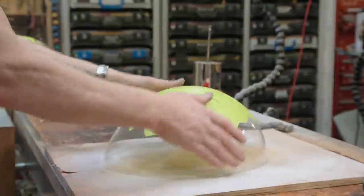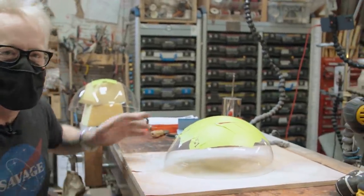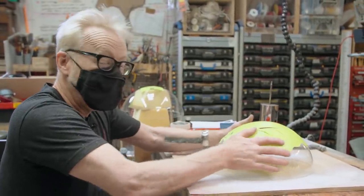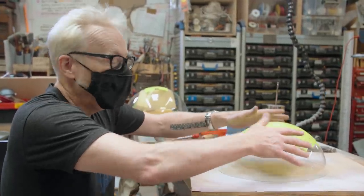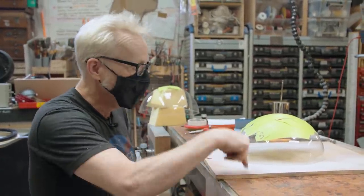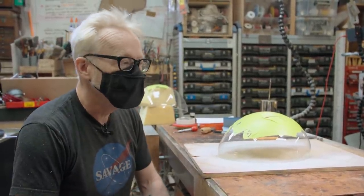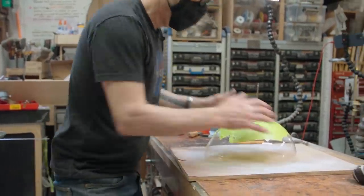I am going to sand this. This actually is a really, really important technique in model making. The large board with sandpaper glued to it is your friend. It may seem like flattening this by doing this for a while is laborious, and that's because it is. But when you take two vacuum forms like this and you do this, they meet and life is good. This is a really important modeling tool, the wide flat sanding surface. It'll get you out of a lot of jams, and it's worth having in your mental palace as a solution.